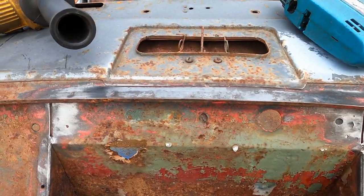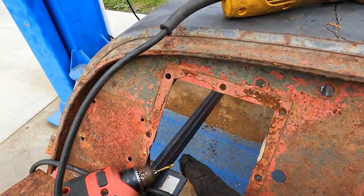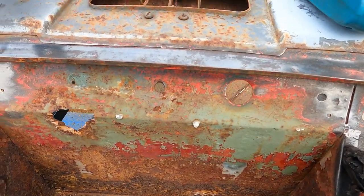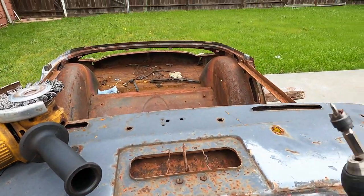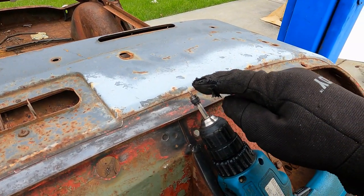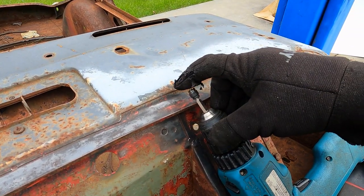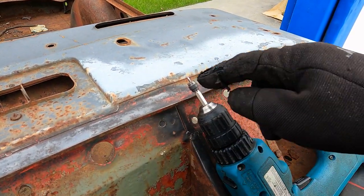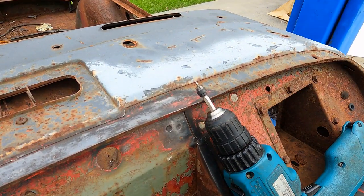The first thing we're going to do is drill 1/8 of an inch. You don't actually need to go through both layers of steel, just the first one, because we just want to make a depression. This is the spot weld driller here. This little point is spring loaded. It just needs somewhere to fall in, and it stops that thing from wandering when it starts to cut.